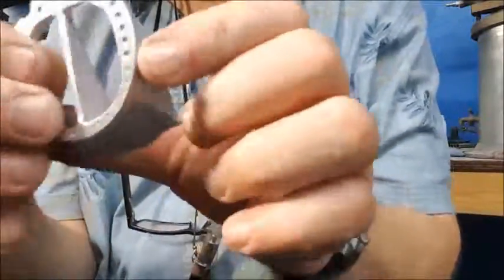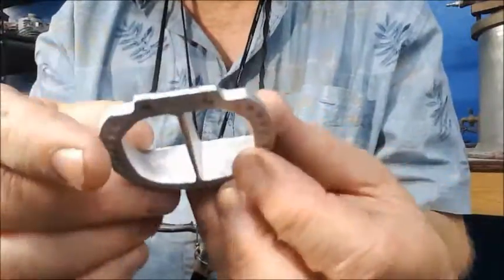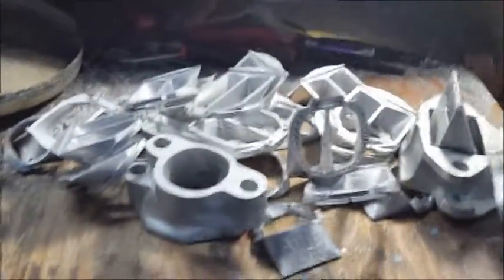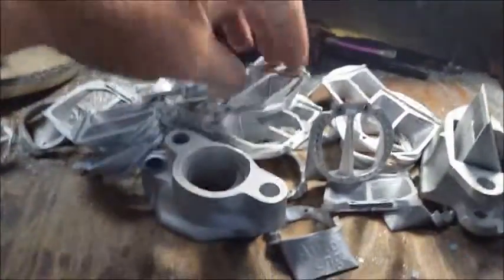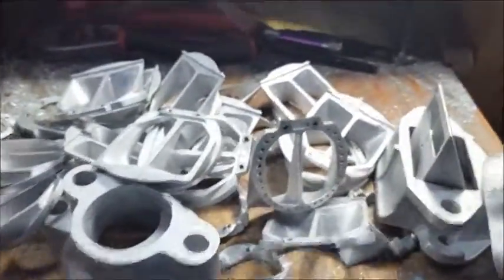It's the same way with the transfer dividers — you want the edge of those rounded so you're not causing the airflow to be forced out at an angle. You want it to hug the separator. That's a little trivia for the day. That's the next step on these — we've got a bunch to do. So that's another step in prepping these castings for building kits. Now on to our next step: we've got all the holes re-threaded and these back sections rounded.